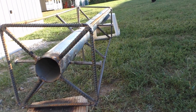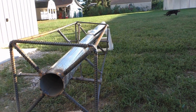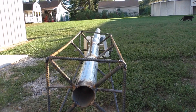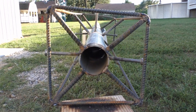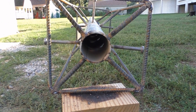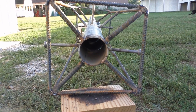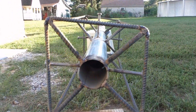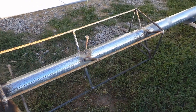Yeah, it turned out pretty good — right there in the center are the supports so she's not going anywhere. I welded it up with 6010 and then went over it with 7018, just for the heck of it. That's what you got — schedule 40 pipe. You can see down there the holes where the concrete's gonna go in those holes and fill her up all the way from the four feet up.